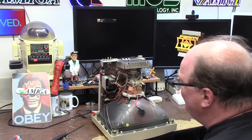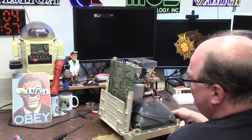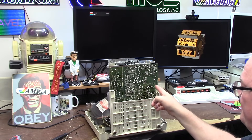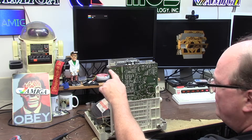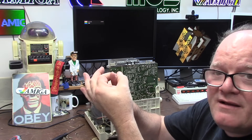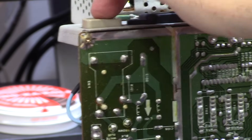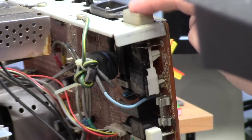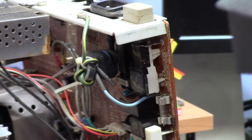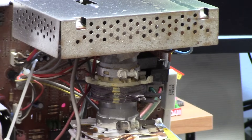Inside there are millions of resistor caps and big components, but I'm looking for the high voltage power rail and anything that looks burned. I'm going to flip it to the bottom and check cold solder joints on the flyback and look for power rail cold solder joints. A cold solder joint looks like a solder joint where the peg moves around — it's been broken and needs to be reflowed.